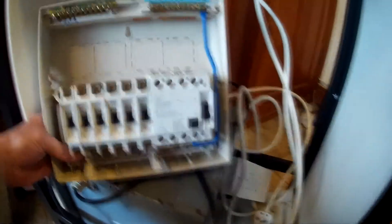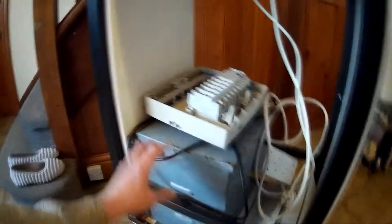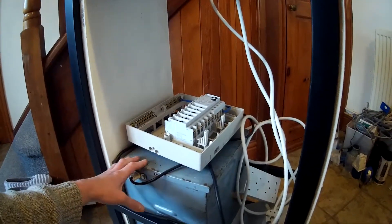I'm just going to grab the camera and give you a bit of a walk around. We're going to take the 32-amp supply you've just seen in the utility room, and that's going to be brought into this — which is basically a domestic consumer unit with an RCD and some circuit breakers, mounted up there. In the bottom we've got a 4kVA, 110-volt transformer, but what I've found in the past is it's quite happy to have 240 volts put backwards into it — I know it's probably dodgy — but that does give us 400 volts out, which we can play around with if needed.